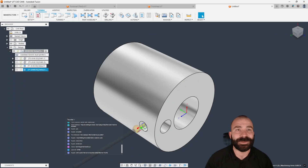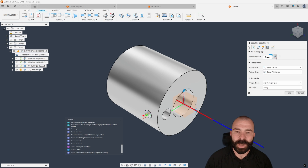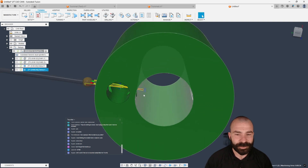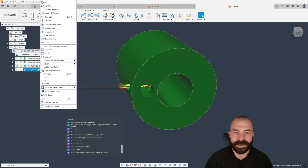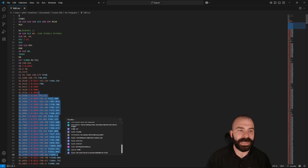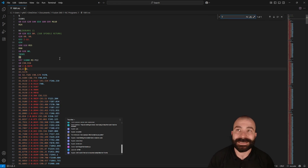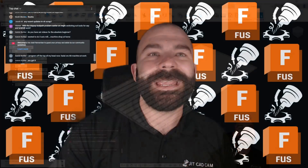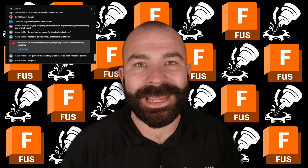So I'm going to go ahead and switch gears. Regarding the live tool mounted radially like a T3 drill — all I've done so far is one, we are in three axis mode. We could swap out to four axis mode, rotating around that center of rotation, and from that we should get basically an identical toolpath. It'll look weird because we're now tilting the part, not the tool. Posting that out, we will now see there's going to be C axis motion on that toolpath. You do still have a Y zero coming through but utilizing the fourth axis for deburr and for live fourth axis tilting you would need the extension. Feel free to reach out to us at JIT CAD CAM — we'd be happy to sell it to you if you're in North America. It's not what you guys know, it's who you know. And you all know yours truly over here — that is Fusion Phil.